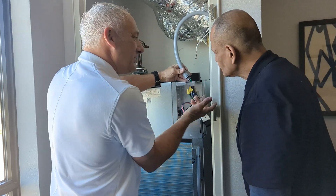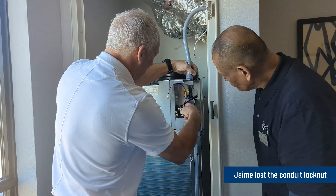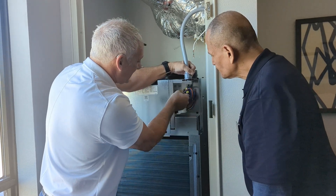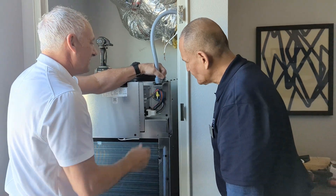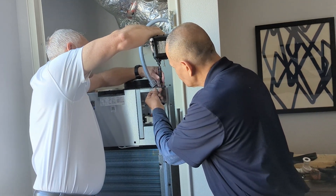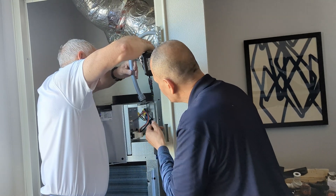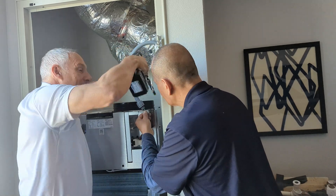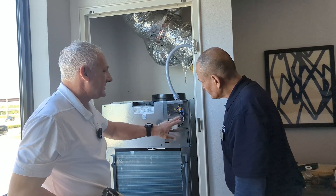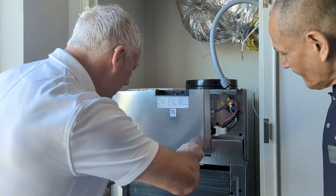We need to put our nut in to secure that, and then we'll plug in our power connection right here. Our personality plug plugs in right here — again, that's to let the unit know how much of that universal heater is going to be used. Just for demonstration purposes, we will come back and get this secured, but that's how the electrical installation works. It's very simple, rather than having to run your wire into the control panel and deal with three lugs that you have to fish the wire up into and tighten with a screwdriver.